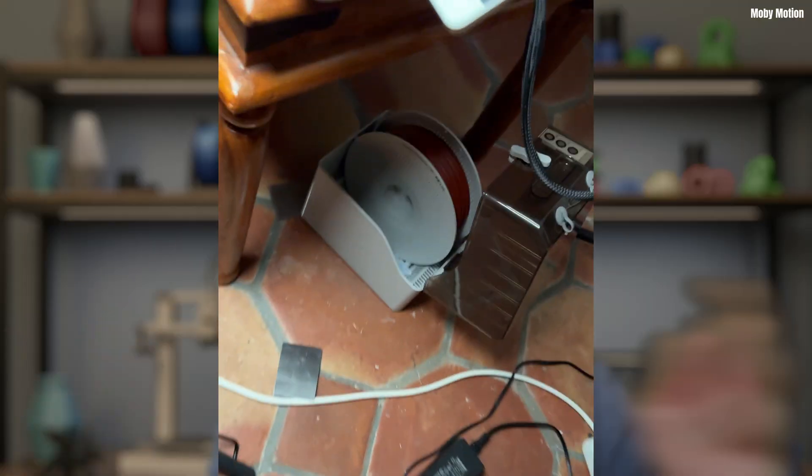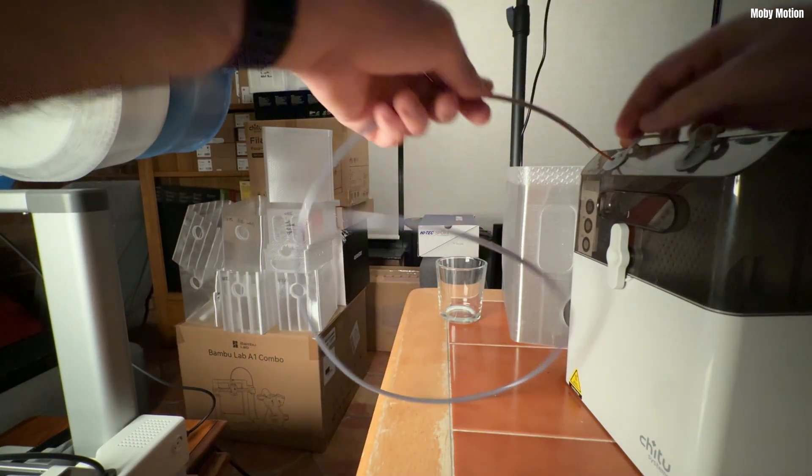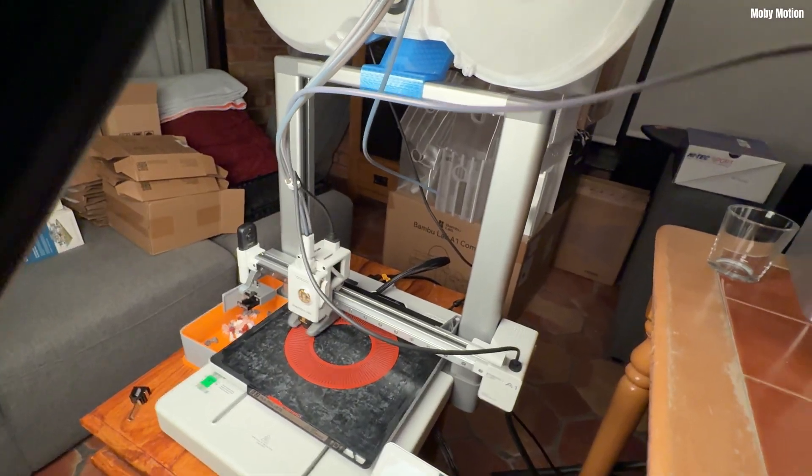There was a small issue initially. I'd clearly forgotten tip number five from my 13 tips video and did something very stupid — I printed with a little bit of PTFE tubing in the dry box and in the printer but I didn't have a length of tubing in between, because for some reason I thought that wasn't necessary. Then as the print head moved, the whole dry box came down with it, fell onto the floor, and the print stopped with an error. I quickly realized the mistake and set it up again with a whole length of PTFE tubing, so there's a constant length of filament between the dry box and the printer with no sudden movement issues.